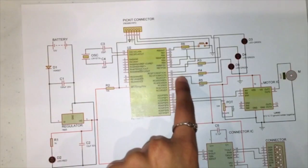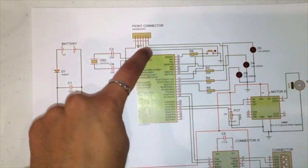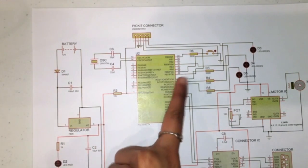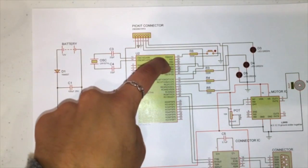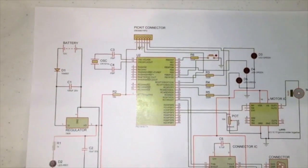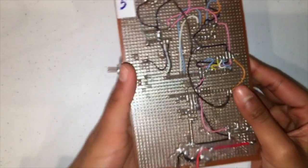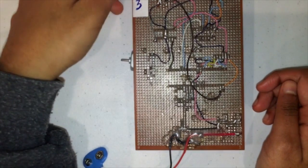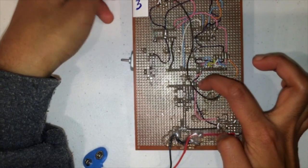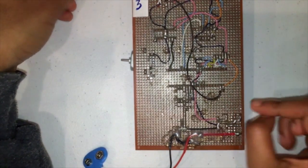So you can follow the 4th pin right over there. The 5th pin should go to pin 39, which is PGC, and the 6th and last pin is going to pin 36, which is PGM. So there you have it, the 6 PICkit pins, and flipping this board over, you can see that each of these connections has been made. And do note right here that the 2 VDDs and the 2 VSSs are connected through a wire.